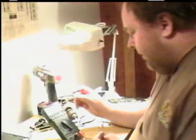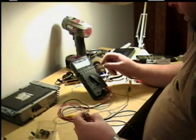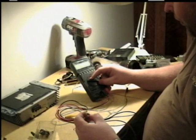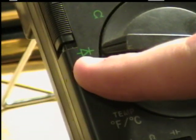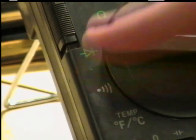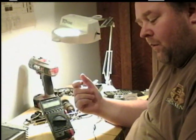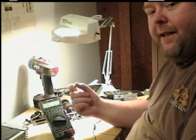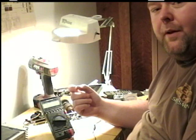To test these, I'm going to show you what to do. I've got a test meter here. What I need to do is turn it down to the diode setting, which is identified by that marking — an arrow with a line in front of it. This will measure diodes. Silicon diodes require at least 0.6 volts to conduct, which is called the voltage drop, because it requires 6 tenths of a volt for the valve to open and start conducting. It's called the forward voltage.